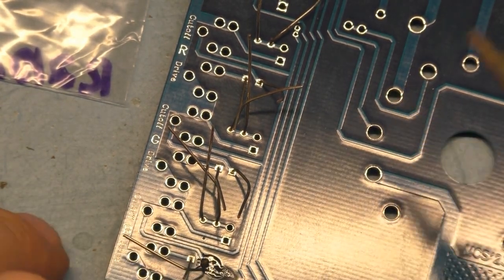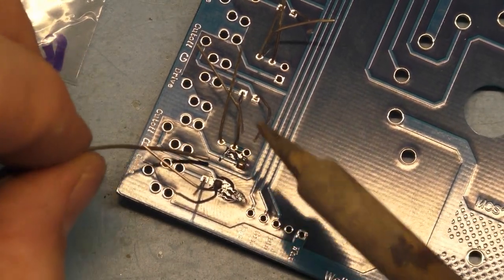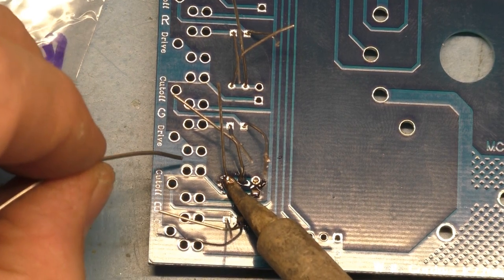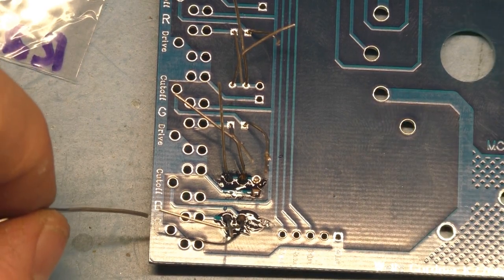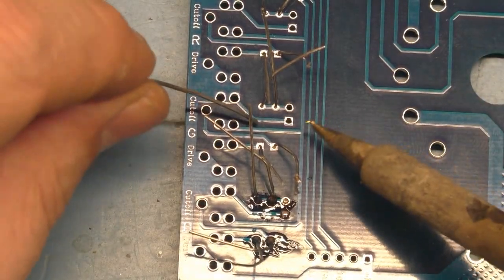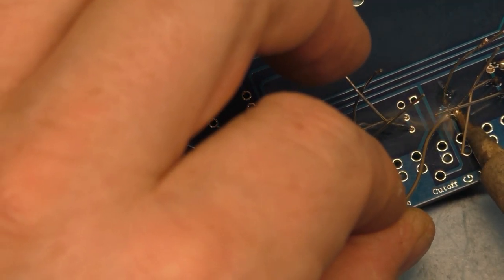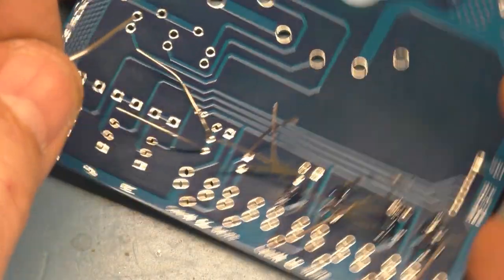And the reason I wanted to build the other one first is to verify there weren't any actual issues, because if we're trying to repair this chassis, and when we get done working on it, if we have problems, I want to make sure that it's not a problem with the neck board here that we're testing, because I don't want to shoot myself in the foot. So I did the 7-pin version first and verified that when done correctly, it has no problems. So that's why I did that one first. So now if we put this together properly and we have problems at the back end, we know it's not anything with this neck board.